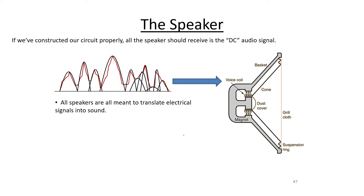With this video we are cleaning up the last little bit of our AM radio receiver — the simplest one I could find and pare down so that we could understand it with the tools we already have. The very last part of the whole process: taking in an electromagnetic wave on the antenna, turning that into an electrical signal, filtering those signals, selecting just one, sending it to the detector diode, and getting it chopped in half — as you can see in this diagram of the input for the speaker.